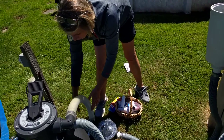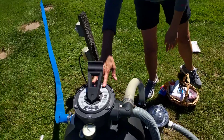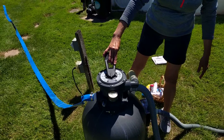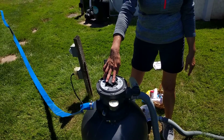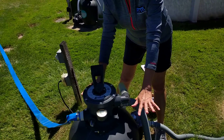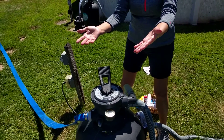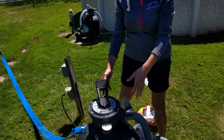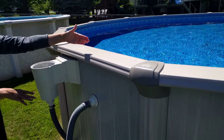From here, the motor turns the impeller, which then takes the water up through your filter hose and to your multi-port. Your multi-port valve is really the directional for the water. 99% of the time you're going to be on filter or filtration — it's just taking the water, shooting it down a pipe. There are little fingers or laterals at the bottom that take that water and bring it back up through the sand. Any organic material is getting caught in that sharp coarse sand, gets filtered out through the sand, back through this hose, and then through your return jet back into the pool.